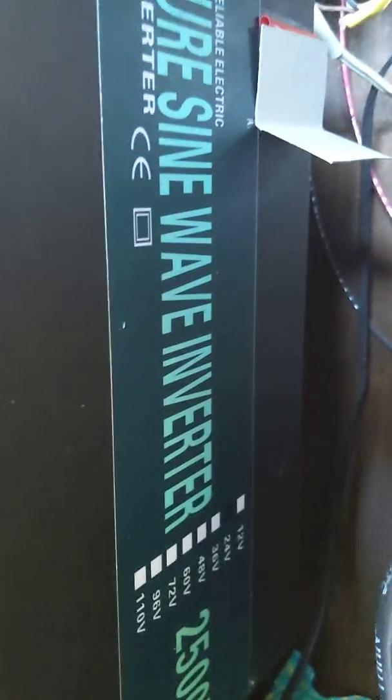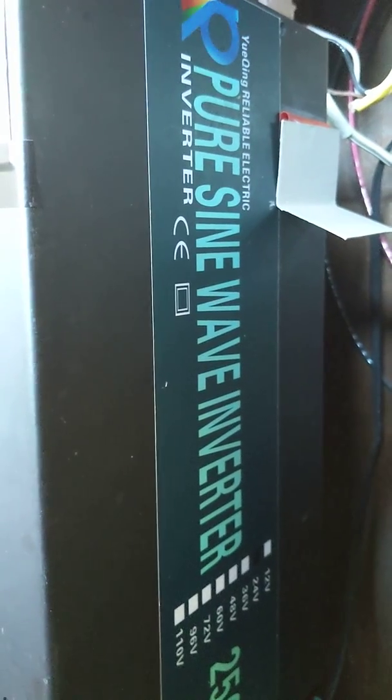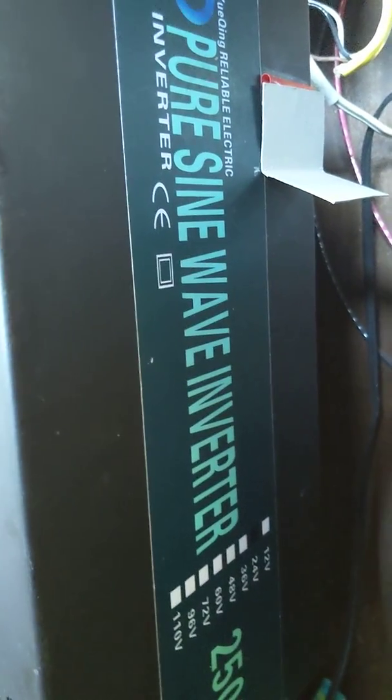they use these same housings so that they don't have to spend a bunch more money on everything. So there's just a little drop-down menu when you check out that you can choose the voltage, and it's critical that you get the right one. A couple people that I've talked to have accidentally ordered the 12-volt one because they didn't realize. But it definitely, absolutely has to be 24-volt to use the Leaf modules. That's the only thing that it has to be.